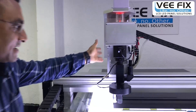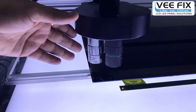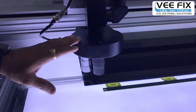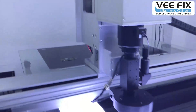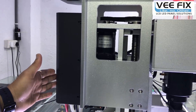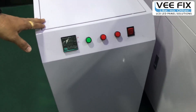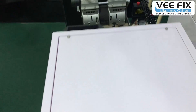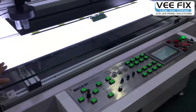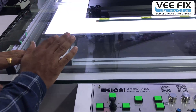Here is the Z direction movement with the microscope. Three lenses are installed in this microscope: 20x, 10x, and 5x. On the back side of this assembly is the laser source. For cooling of the laser source, a cooling system and a compressor both come with this machine. This is the moving platform — on that platform we can repair an 80-inch panel very easily.